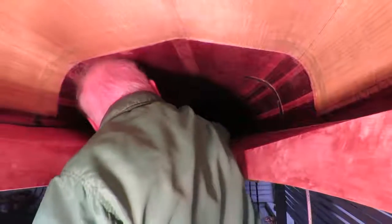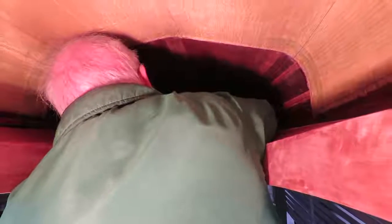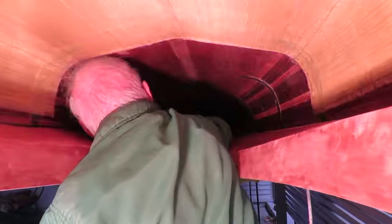Okay, it's going to be hard for you to see very much up here, but what we're doing is coating the center line now as far forwards as we can reach. We use plenty of epoxy here because it will just settle right into the groove where we want it. We mixed up 4 clear. We have the bow of the boat slightly lower. Let's see where this runs. We really won't object to its running forwards farther than we can reach. That would be kind of nice. So we're dumping that. That may be easier than the fillet, and we'll be using fiberglass tape here too. So just spread it wide enough for the fiberglass tape, and we'll leave a fairly thick sort of coating in there. Reach as far forwards as that brush will reach.